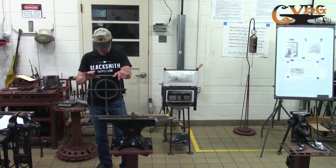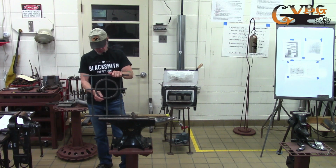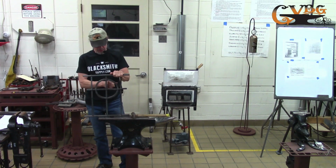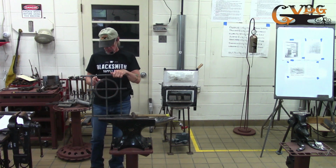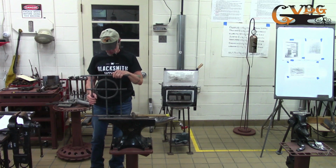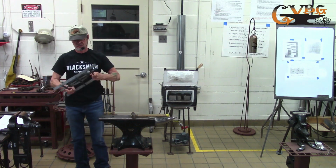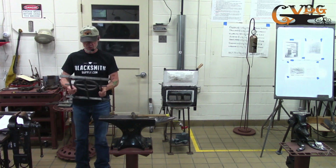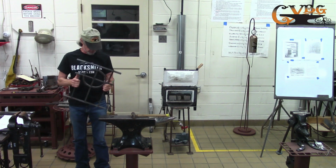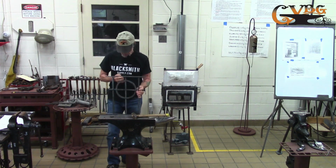The hardest part I had was the circle. This is free-floating. And the trick to that is to cut this piece in half and then forge weld it back together. And this piece, to get it together, is forge welded here. To do that, you have to put the whole thing in coal. So it's manipulating this whole thing once you get it hot enough, particularly in one place, so that you don't burn up another piece. But anyway, that was the choice that I did.